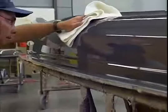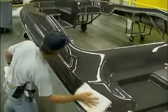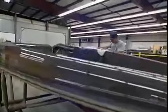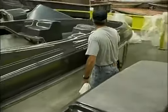Measurements are checked, all surfaces and detail lines are checked, and the mold surface is given a final quality audit. After all design and quality criteria have been approved by top management, the glass master is made. It is from this master that all molds used in production will be generated.